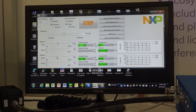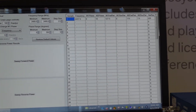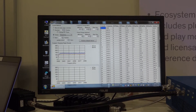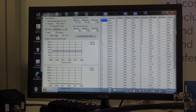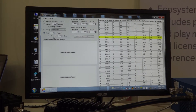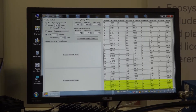Some additional features that NXP has built into the GUI are on the right side of the screen under extended features. You can operate manually, run in random mode, or do a frequency or phase sweep of each one of the modules. You can select between 2.4 GHz up to 2.5 GHz in step sizes down to 1 MHz for your frequency sweep. With 2.5 MHz steps, we'll run through and do a frequency sweep. On the right-hand side of the chart, we have all of the output readings from each of the modules. Once we get that output data, we can set the best five points — highlighted in yellow — which represent the lowest VSWR, highest forward power, and lowest reverse power in each of those power amplifier modules.